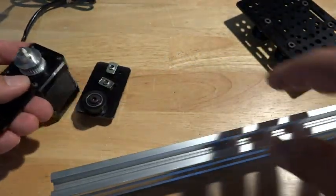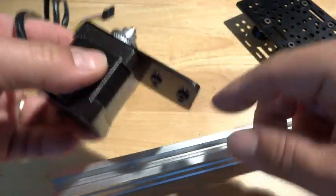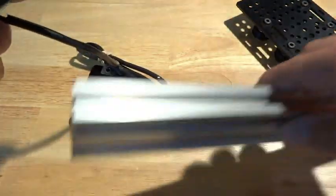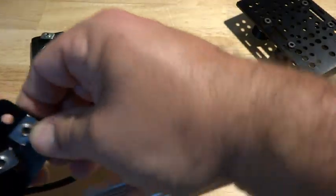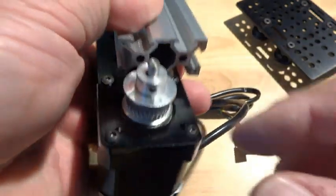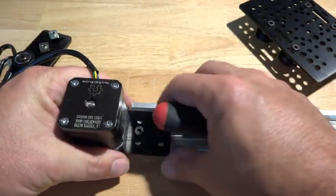I'm going to take my motor — you can see it's kind of reversed the way I put the screws through. Eight millimeter screws with some T-nuts, and I have my GT2 30-tooth timing pulley. It's bigger, and the idea is that it allows it to run through the channel and above the rail itself. Slide this on here — I have these in the middle holes. You can see how one side will go through the tunnel and the other side will travel on top.